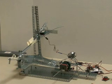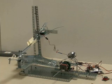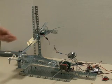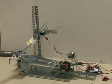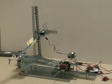What we do is as it comes down a ramp, by the weight and the velocity of the steel balls, it will allow the steel balls to be cast out of the side, so we're left with the lighter ones flowing down the other side of the lever arm here, going to a guiding hopper bin down to the bottom, where we have a light sensor reading off our flashlight, and by the values read off the sensor, that's allowing it to go into another basket